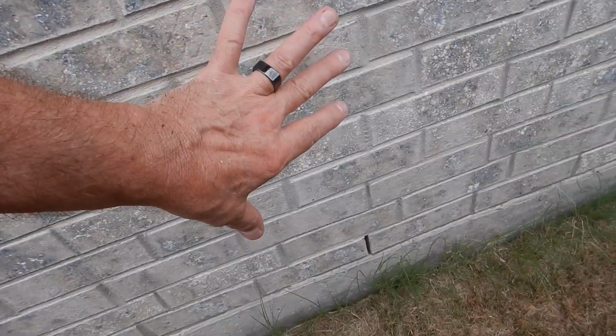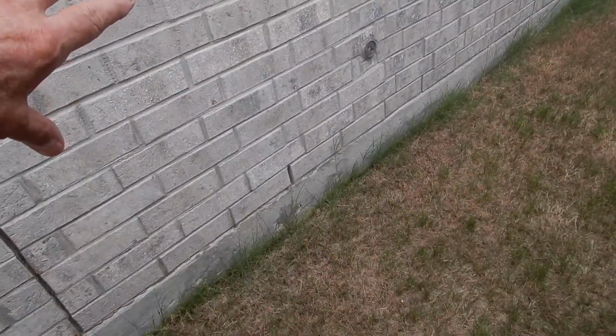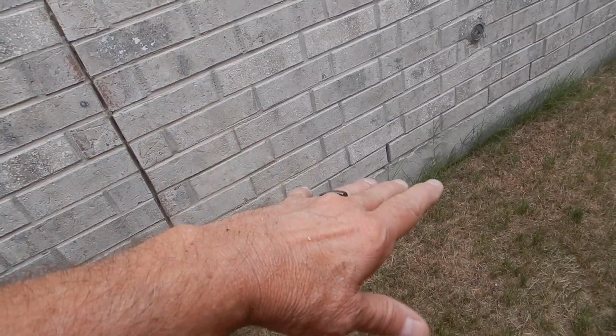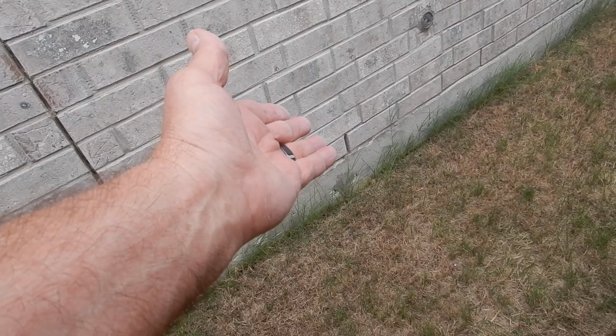Now, most of the time we have a drainage plane behind the brick, I guess. I wasn't here for the pre-drywall inspection. This is a 1-year inspection. I wasn't here for the pre-drywall inspection, but we're doing good faith. We've got a drainage plane behind here. Any moisture that gets through the brick travels down the drainage plane. And again, by the time it gets down to here, we're just dealing with vapor. And if you have an event, an emergency, I've seen water come out of these. I hope you don't, but they're capable of doing that.